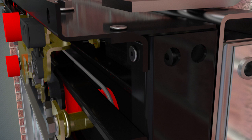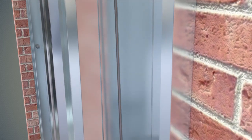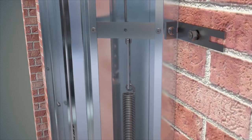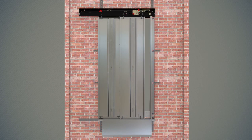The three-millimeter-thick rope, mounted inside the mechanism plug, and the perforated plate connection hook at its end are tied to a spring that is 39 centimeters long with a 22-millimeter outside diameter, available in the package. The other end of the spring is tied to the internal support plate at the side frame through the wire hook already tied to the spring. Finally, the assembly of the lift landing door is completed.